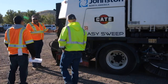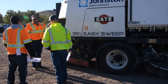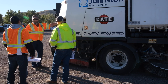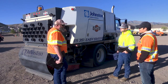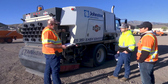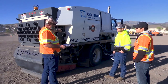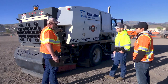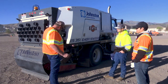Here again is the back broom adjustment for this side. Be careful because you can actually throw them off. This is a really nice ride when you're going slow, but when you're going fast, it's a short wheelbase so it tends to bounce you up a little bit. Seatbelts of course — you're going to be wearing your seatbelts. One thing you're going to want to check: when I'm moving from location to location, if I hit a bad bump, I'll park the truck where it's safe, get out, walk around back, and check my chains. I've actually had this chain jump out of track once, and it threw my broom off kilter.